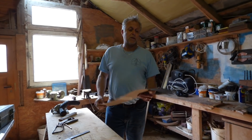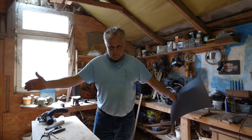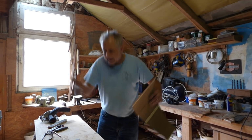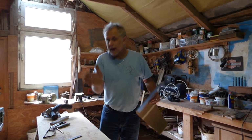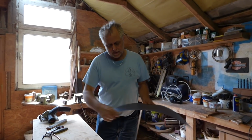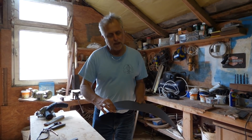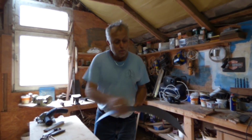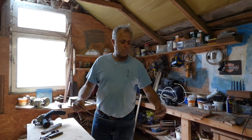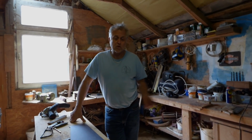What you've got to remember is that obviously length has got to be cut correctly, but for the width, or anything that's overhanging or coming up to an overhanging edge, you want to cut too big. So you glue it on too big and then you trim it off in position. So the fact that that is a bit chipped at the edge there didn't matter, because you're cutting it a good 2 centimetres, an inch even, too big, and that'll be trimmed off later. So cut it up carefully. It involves a lot of careful measuring, marking out, and trying it in position, really.